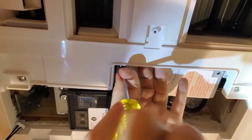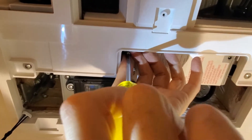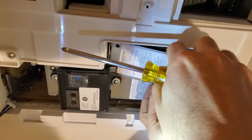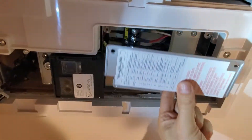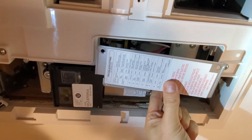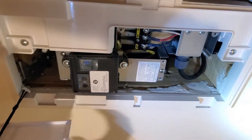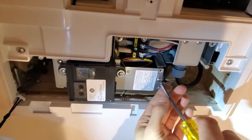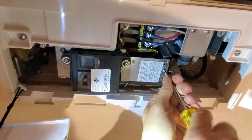Hold this panel — you're working against gravity and it's going to fall on your face if you don't catch it. I'm going to catch this second screw, and here comes the first electrical cover. Remember how it goes in — it goes in so you can read it from this position. Now I'm going to loosen the third screw just a little bit.